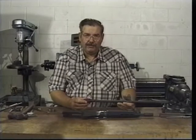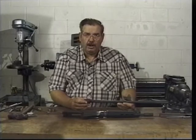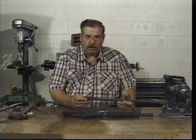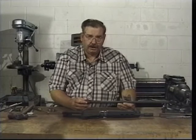Now, following standard practice with a die, you're going to thread the barrel all the way up, okay? Obviously, you're going to turn it a little bit, thread it, take it out, and get it finished. Now that we've corrected the threads on the barrel, this barrel will now fit an inch receiver or a metric receiver, but it does not require a washer. The barrel type determines a washer. An inch barrel needs a washer. A metric barrel or an Israeli barrel does not need a washer, even if it's used on an inch receiver.